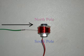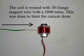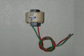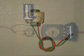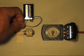There's your reference. I wound this coil with 30 gauge wire at a thousand turns. I did that because I didn't want it to draw a lot of current. Here it is finished with the polarities written on it, and the arrow you see in the center is the actual direction that I wound the coil. I'll power this up so you can see it in action — I'll power it up and down a couple times so that you can see the effect.